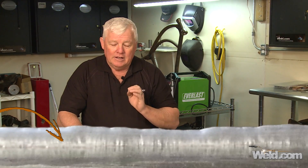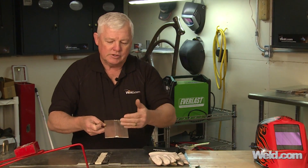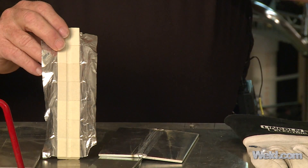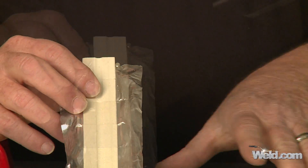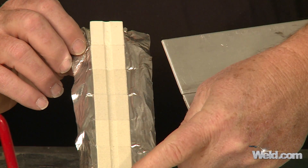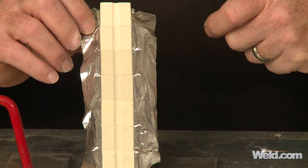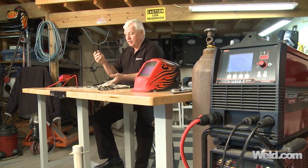So if you turn it over and you have penetration, you have a line down the center — it's like a phantom line — that's just an oxide layer. Now, the uniqueness about this isn't just that I'm welding it. The uniqueness is that I'm going to put a backing bar — it's actually a ceramic type of bar — and if you take a look at the groove, when I get full penetration rather than freefall, it's going to hit that groove and form the shape that I need. So you'll see this used anytime you need controlled penetration.